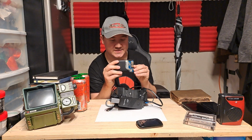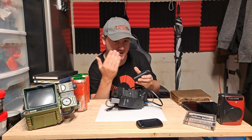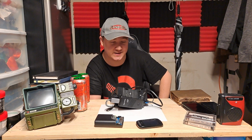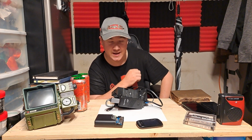Now, it is important that when you get a battery pack, like the one that I'm disassembling specifically for this, because I'm going to be moving the casing to where the battery is inside it, and I need it stripped outwards, that you get one that is capable of supplying 3 amps. Because the compute stick requires at least 3 amps to run. I know this because this is the weakest one that I could find, and even it requires 3 amps of power. Any less, and it will not boot. It is just incapable of booting at anything less.